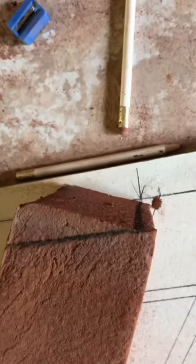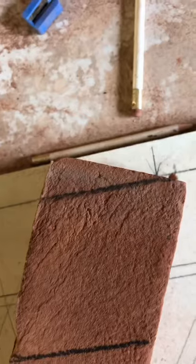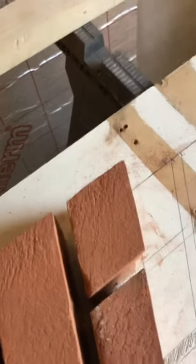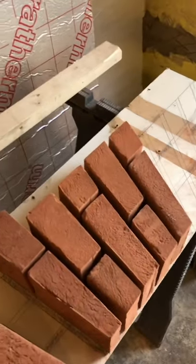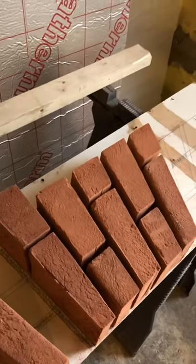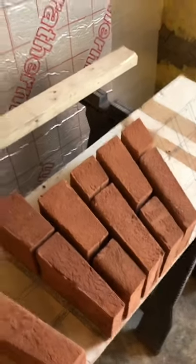On this bit, I'm just placing the brick where it intersects with the mortar line and the top of the arch. So I've just cut the top brick on the fourth course. I've made this board purely to stick all the cuts on — it gives an idea of what it's going to come out like. I'm halfway across one side, so it looks quite good — I'm quite happy with it so far.